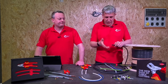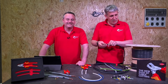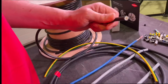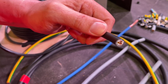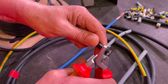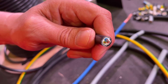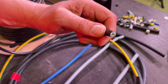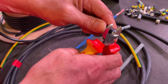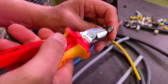Not NYM - we don't use that - so let's try it on some cables that we have in the workshop. Is this the tough sheath? It is - in Europe it would be known as NYY, or certain wholesalers sell it as that, but we use this a lot. Starting with the step cut - watch this. Let's look at the end when you cut the next one. Kept the round end - because it can go up to four millimetre squared, five conductors, which is well within its limits. With the side cutters, it's not difficult to cut but look at what it's done to the shape of the cable - squashed it.